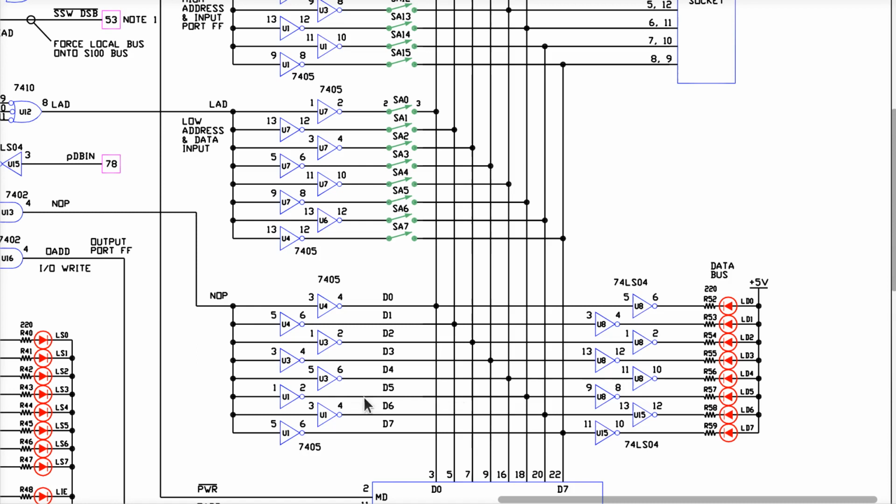This gate can do that on D5. If this gate is told 1 over here, and it's always 1, that will pull this thing to ground and leave it there. Okay? So this is one of the possible things that could go wrong. Maybe this signal over here is broken. But as you can see in the schematic, if this signal here is broken, then every one of these should be driving low at the same time. So this signal is probably not our problem. Plus, we can put a probe on it and have a look-see at it. And, you know, why? Because they'd all go low.